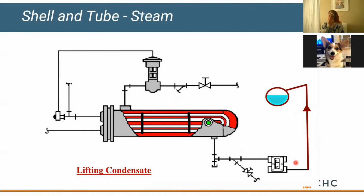And guys, I tell you in general, if you want to tear up a heat exchanger, start lifting condensate. Every job I've seen where they lift condensate, they're always complaining that their heat exchanger only lasts 6 months to a year, regardless of the size. Okay, but yeah, good point on the check valve. I still think it's a problem.